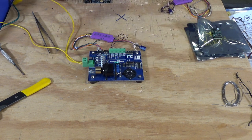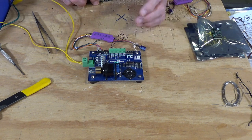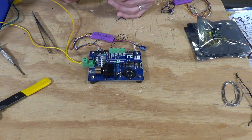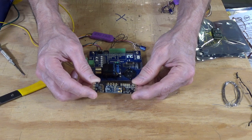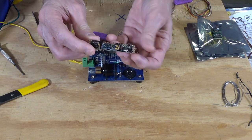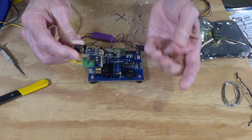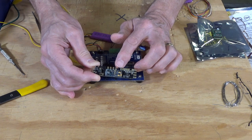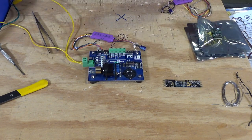The great thing about this is it allows you to test most types of decoders in advance. Say you go to a train show or you're on eBay and you find a great deal for decoders — you might want to test them before you install them in a locomotive. There is one kind, though, that you really can't do that: the Athearn/Atlas style board-type decoders that go in a lot of locomotives being made today. The problem is, in order to test these, you have to wire them up — add a speaker wire, a motor wire, at least two power pickup wires, outputs for your headlights. By the time you go to the trouble to add all those wires to do a benchtop test, you might as well just install it in the locomotive and give it a test that way.